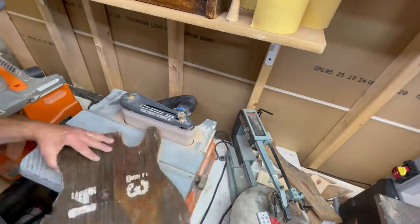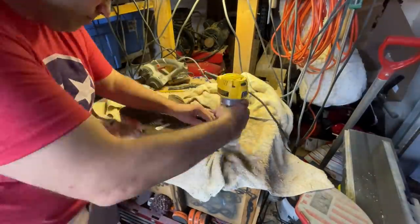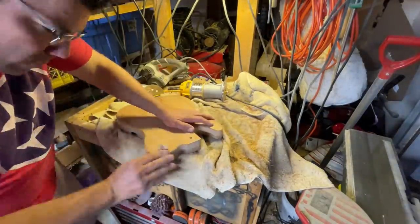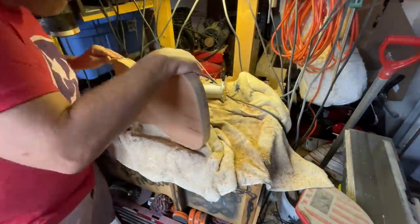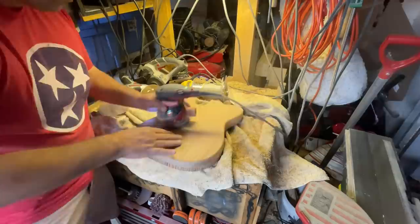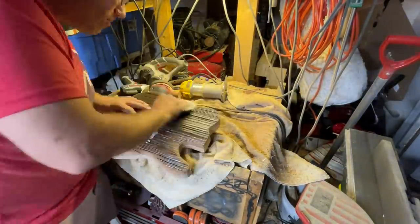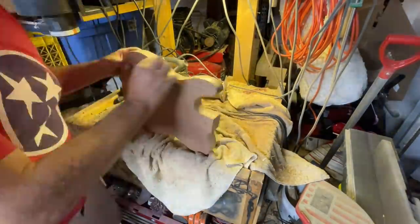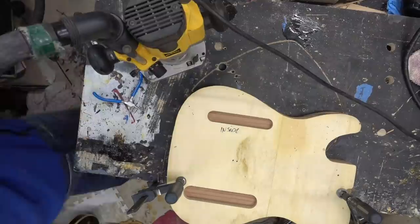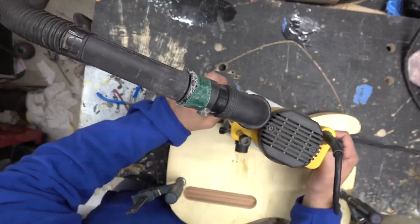A little back and forth and we're nice and clean. We're then gonna put a quarter-inch edge on it on the front and the back, sand up the sides some more. Then we get the power sander going — usually start with 180 to 220, and then depending on the body we'll go up to 320.